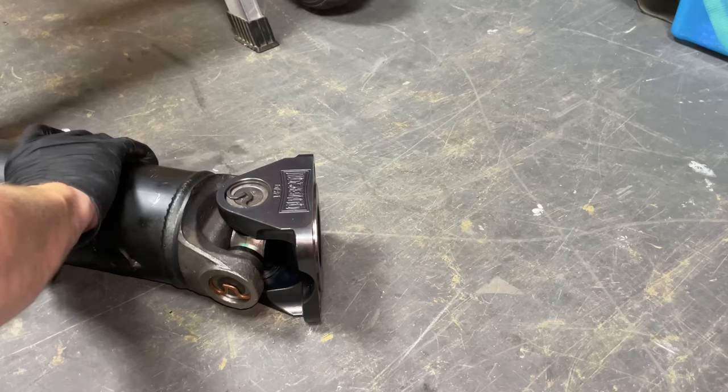Now, one little problem that we did have was the steering. Because we've got a differential locker in there, it makes it very hard to steer at slow speeds. The steering wheel locks up solid, and I'm forcing it as hard as I can, and it just won't move. If I start revving it a little bit, it unwinds the diff and probably gives the pump a little bit more pressure, I don't know, then it kind of steers.